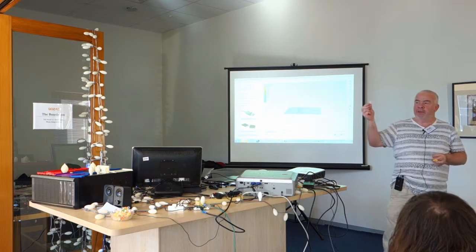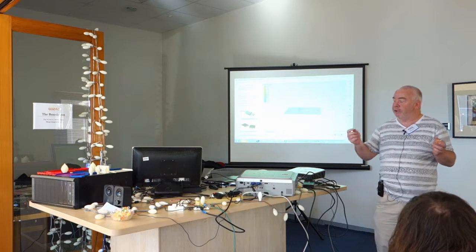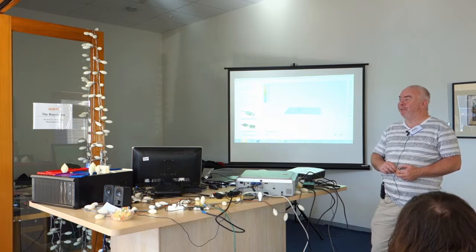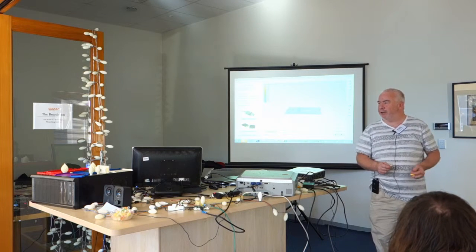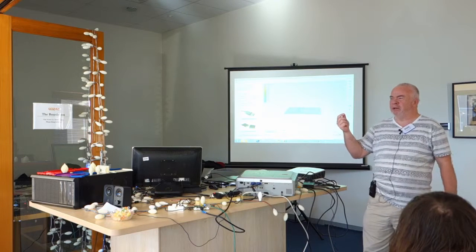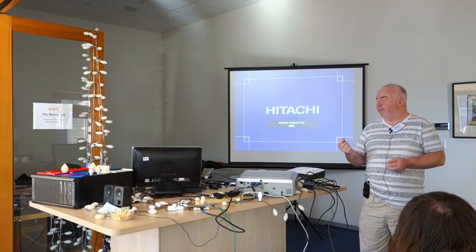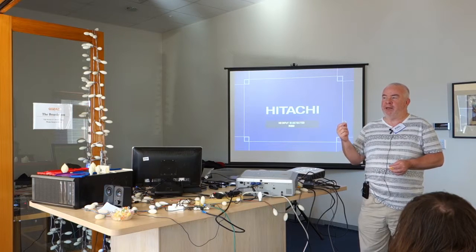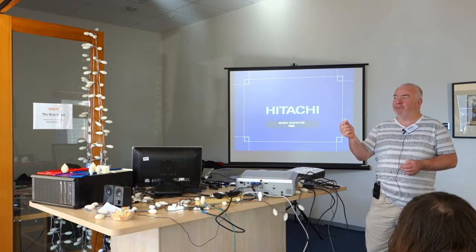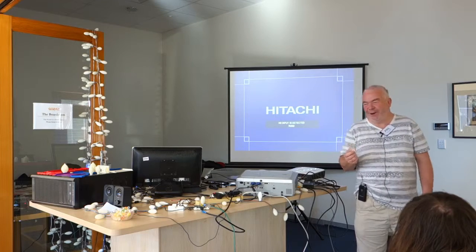So the natural colour ABS, if you jump on the websites and look at UV safe and stuff like that, all plastics degrade in the sun. Don't use ABS outside, don't use everything else outside. A whole bunch of stuff has got ABS outside all the time. Even nylon degrades, and we see it with the cheap cable ties. Unless you're buying special UV inhibited plastic, this stuff will eventually degrade. But really, if you get 3, 4, 5 seasons out of it, print another lot. Who really cares? You update that item anyway.